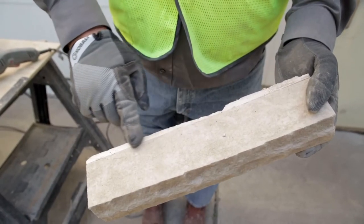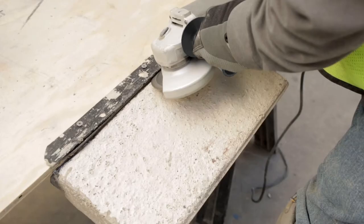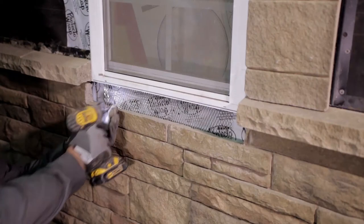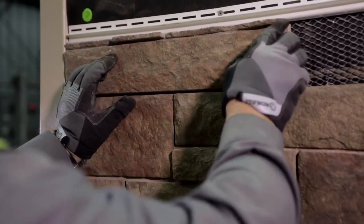In some cases, the nail flange must be removed from the panel to install it into soffits, windows, or other terminations or penetrations. We refer to these as a partial panel installation. Please see the written installation instructions for additional information on partial panel installation. Using your saw or grinder, cut off the nail flange evenly so that it doesn't stick out above the stone. Prepare the wall for the adhesive bond by attaching a non-painted flashing or galvanized expanded metal lath material. This material must be fastened to the framing. Next, apply thick vertical beads of PL90 construction adhesive to the back of the panel, then place the panel's tongue into the groove of the panel below and press firmly against the wall for even contact. It is critical that contact between the adhesive and partial panel is maintained until the adhesive cures. It may be necessary to install shims or supplemental fasteners for this purpose.